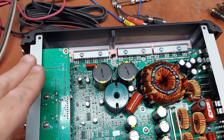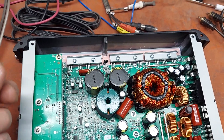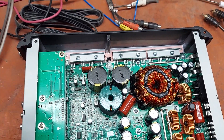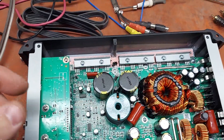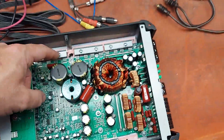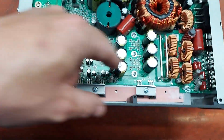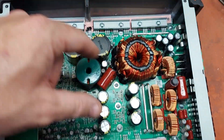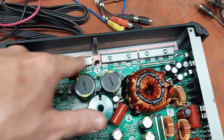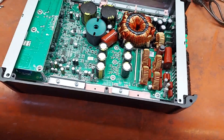As you've seen in Brazilian amps, what they do is use a higher voltage device. Instead of running a rail voltage of anywhere from 30 to 40 volts, they run a really high rail voltage like 200 volts — and the device is rated good for 250. I don't know exactly what's in this thing, but looking at the board: one, two, three, four for the highs; this is a rectifier for the input power supply; and this section is probably just for the Class D bass channel at 600 watts.